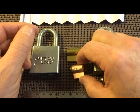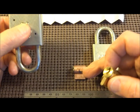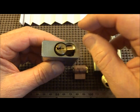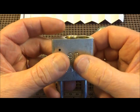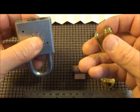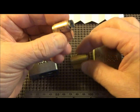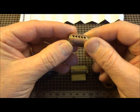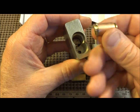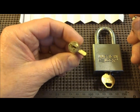So now I've got a big problem and I've got to fix it. My first instinct was to simply throw away the new core, take the old-style six-pin high-security core, drop it in, put the top back on — problem solved. Until you look at it closely: it sticks out. We can't put the armor plate back on the bottom. The new core and old core are different lengths — six-pin versus five-pin. When Master replaced the core with this cheaper, less-secure version, they also changed out the cam on the inside to make it longer to accommodate the shorter core, so it sits flush and you can get the armor plate on. So unfortunately, that's no longer an option.